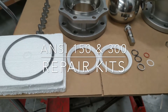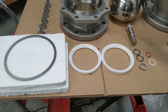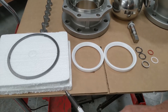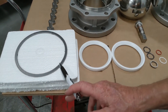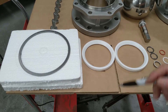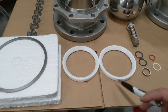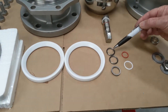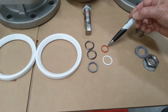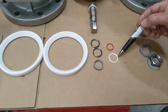The repair kits for the two-piece FireSafe NC150 and NC300 ball valves. The kit comes with the graphite impregnated seat to go between the two faces, two PTFE main seats, three Chevron crush washers, an FKM Viton o-ring, and also the main PTFE thrust washers.